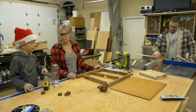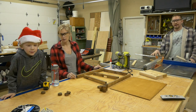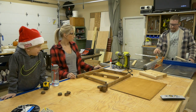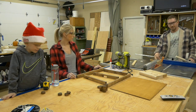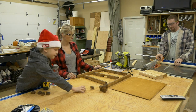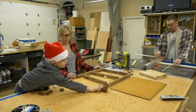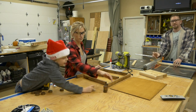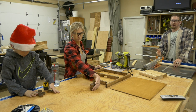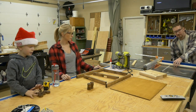This is just a small 3/4 inch board that I clamp to the fence, and what this allows is this is set behind the table saw so that when you push this board, it's set to 1/2 inch away from the blade. When you push this dowel through the blade, you've got more space by the fence so that it doesn't get bound up in the fence and you don't run into problems. So let me go ahead and show you how this works.